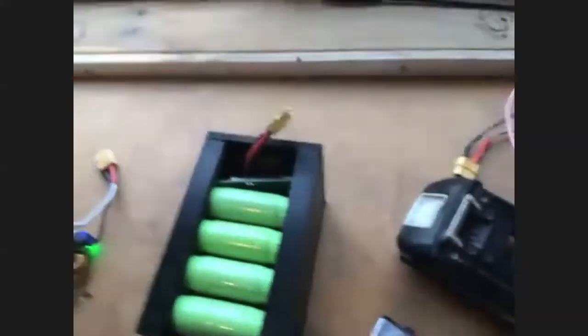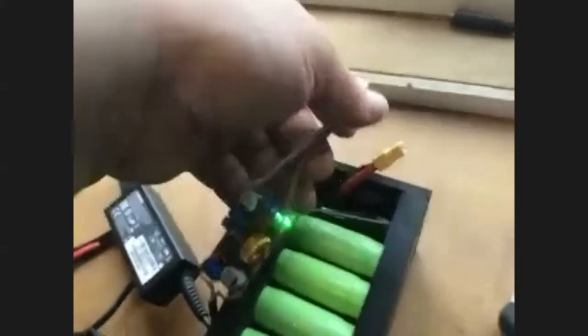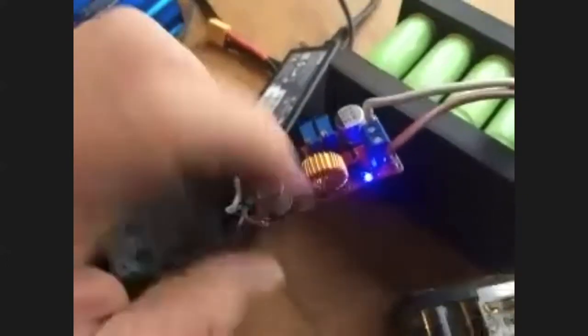There's a green and a blue LED. Right now my battery was mostly charged so we're just in the voltage-limiting cycle. There's another LED next to it that's red for the current-limiting cycle. When you first start to charge them from completely dead you'll be in current-limiting, and then when they get near full you'll be in the voltage-limiting cycle. Does that answer your question?